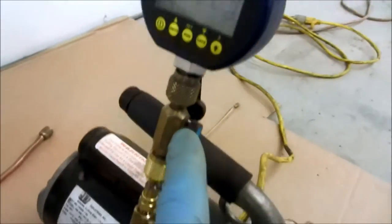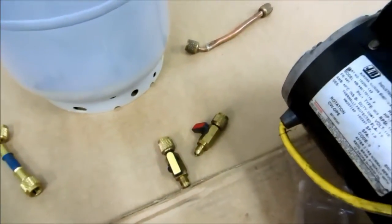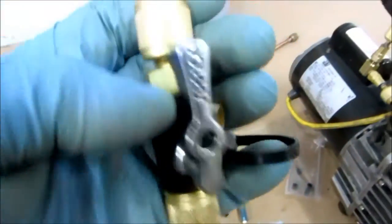I like to have a little shut-off before the vacuum gauge. Obviously it's not vacuum-rated, but I'm pulling down in the 20s, so I'm good with that. And I checked the other two — I'm pulling down like 24. You know, obviously the best core tools are these right here.